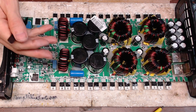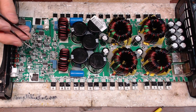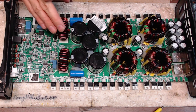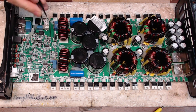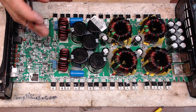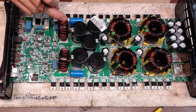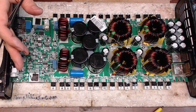So to go over this Tar Amps MD-8000 and what the fault was: I'm not showing any shorts on the output transistors, so I do believe the drive IC is fine, and I'll confirm that when I fire the board up. The number one biggest problem was the output inductor being sheared off — without that feedback, this thing won't run.